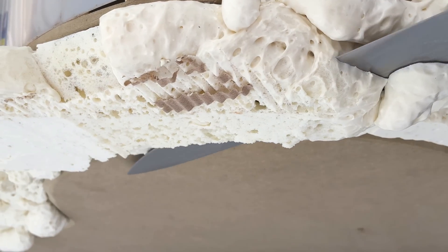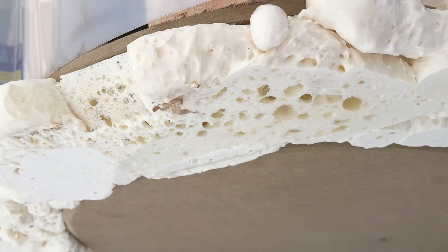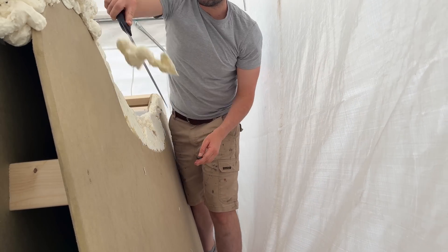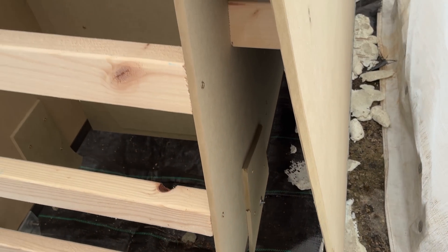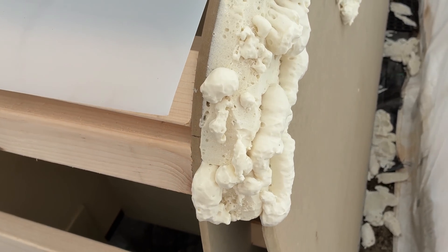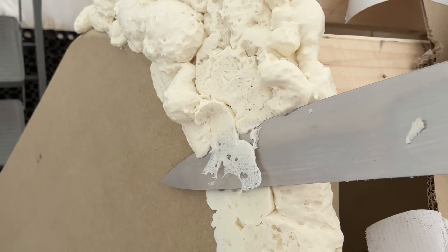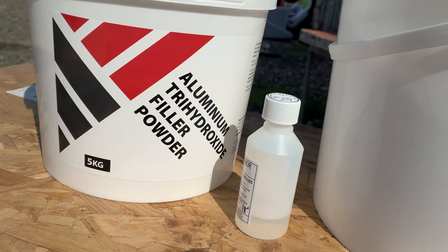What would be the transom if this were a boat — which it's not, it's Bernard. An initial slice with an enormous kitchen knife, then shaping with a mini grinder and an orbital sander. This is the sort of gap we are filling and shaping. A surface needs a release angle to work in a composites layup — fully vertical is good for a transom, but extreme radiuses are a pain for laying up fabrics, so I'm being moderate, which does not come naturally.